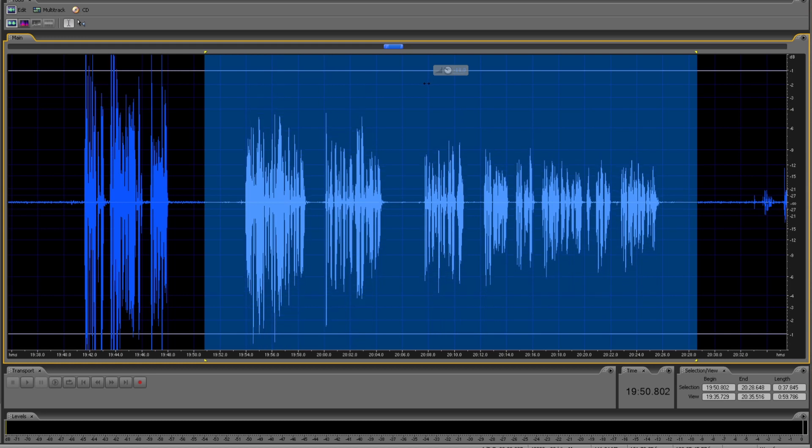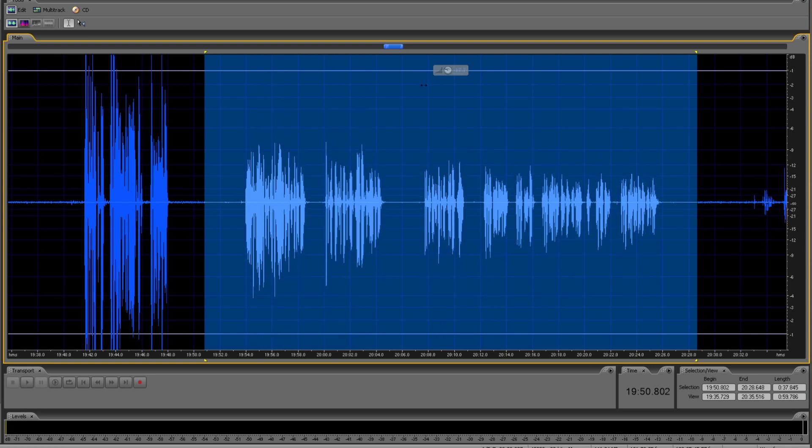There is no manually setting the gain for your audio record level. That's because with 32-bit float — without going into all of the details — bit depth actually pertains to the amount of information used to capture the amplitude or loudness of an audio signal when converting it into a digital file format. Essentially, 32-bit float allows you, the content creator, to adjust the gain level after the fact.